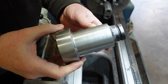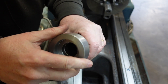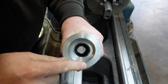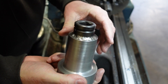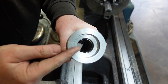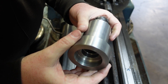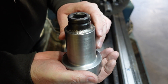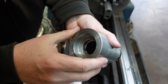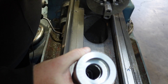The turning is done - I've just taken a bit of material off to lighten it up. I was going to weld the shrink-fit piece in, but I can just pick a line there and I think I'll leave it, because I'll have screws going through here which will stop the two parts rotating relative to each other - so it should be right. The person it's destined for is a welder, so if they feel uneasy they can always run a bead around there if they want to.